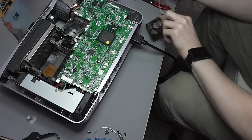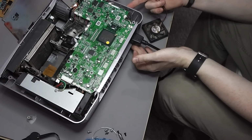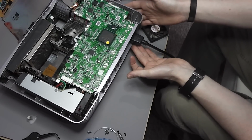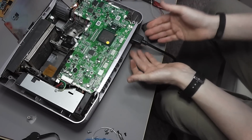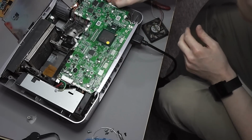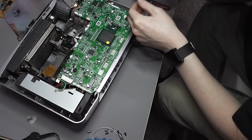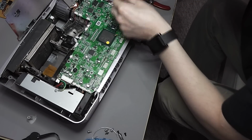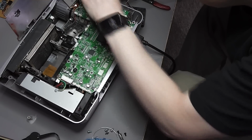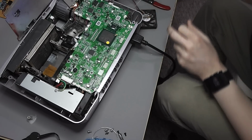And so this one here, I'm just going to check again. I can remember it isn't powering up. Yes, there's a fan just on this side here, which is probably down with some kind of power supply unit. It's where the power cord comes in. But if I pull this fan out here, plug the other one in. Nothing. It's not working again.